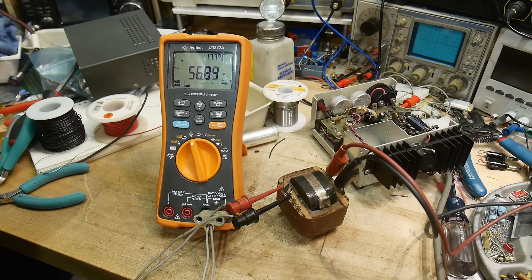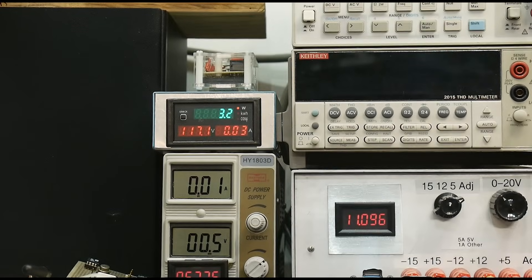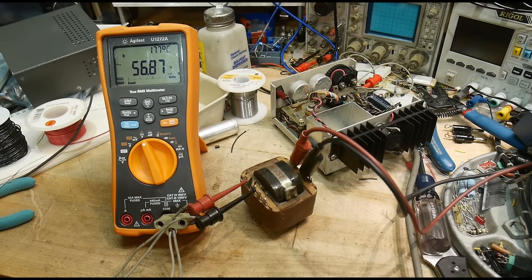Maybe there's something else wrong somewhere. Without a schematic, if I have a good transformer I can just build my own circuit - that's pretty cool. I'm inputting 117 volts at 0.03 amps, so it's not drawing much current. If there were shorted windings we'd expect higher draw, but I only have 3.2 watts of power going in. I'm putting my hand on the transformer and it's fairly cold. Hmm - maybe I don't have to give up on it quite yet.